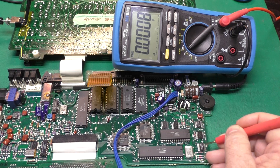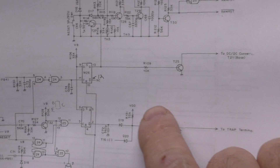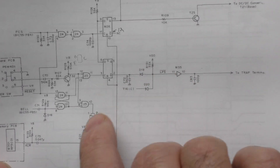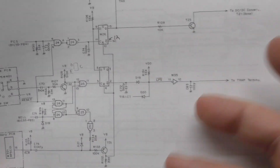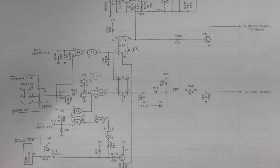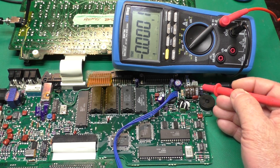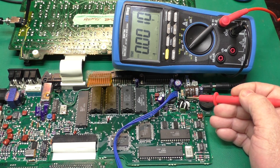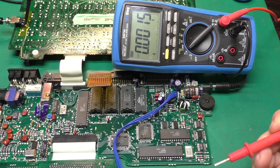Why do we have any output from this chip when power is off? Several ICs need to remain powered for the machine to power on, off, and reset properly — so more than just the RAM is battery-backed. M24, M25, and M26 all remain powered. They're not switching states during power-off so they use very little power. I've seen several odd things happen on Model 100, 102, and 200 computers when these memory batteries go low. The whole power-on and reset sequence depends on these chips being powered all the time.